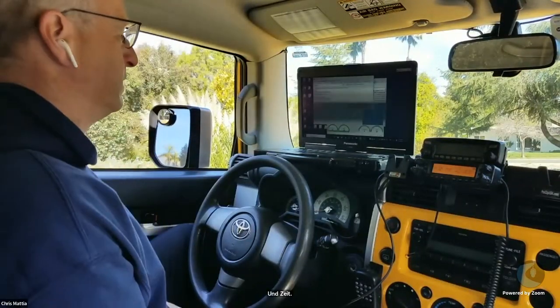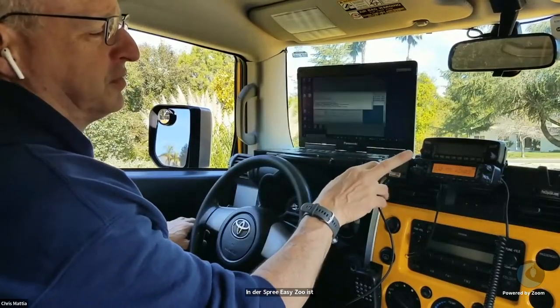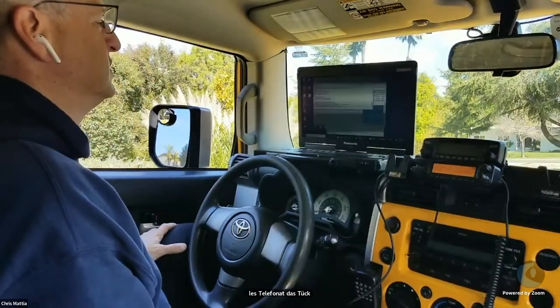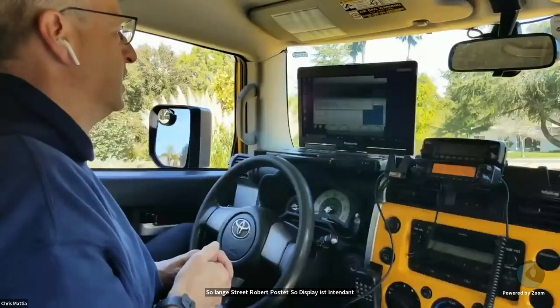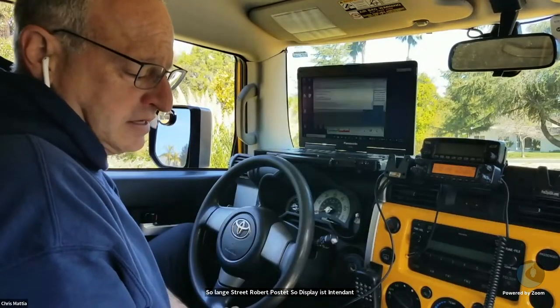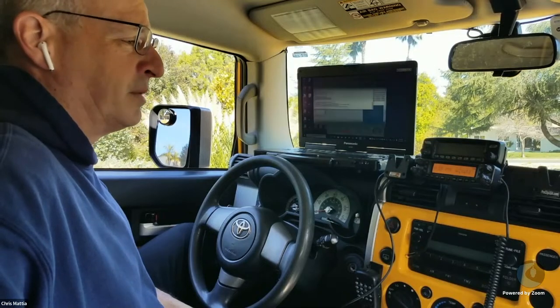There you go — session completed. It's pretty easy, it's always set up to go at any time. At the same time I could flip over to the other side of the radio and have a voice conversation. This radio will support two connections at a time, which is a nice feature. Plus, this will do 70 centimeters, 2 meters, 6 meters, and 10 meters. I also have it set up for the 70 centimeter side, but I'm not going to show you that right now. Any car that has a mobile rig with a data port can be easily set up to do this.